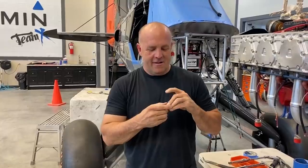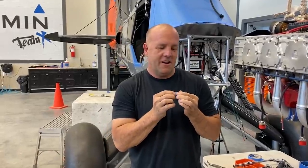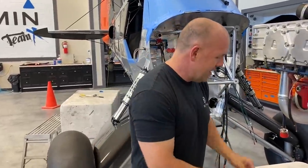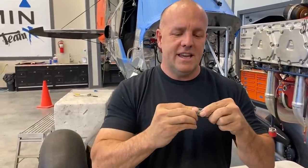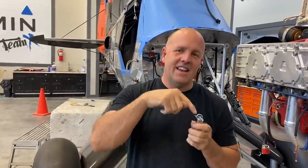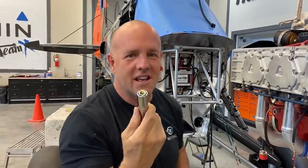Here's a silly little tip-trick. One day I couldn't get a nut to stay in a long, deep socket, and I needed to use that deep socket to get it down in a hole. If you get a piece of tape and wrap it about one and a half times around the nut, take the deep socket and squeeze it in nice and tight — it holds it for you. You can push it in and work it and spin it without the nut going clear inside. I use it all the time. Also, sometimes I use it in reverse — if I need to get a nut out of a hole, I'll reach down, put a little piece of tape on it, undo it, and when I bring the socket out the nut stays with the socket and doesn't drop down in the engine.